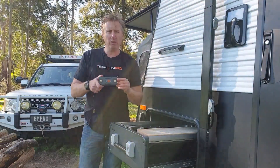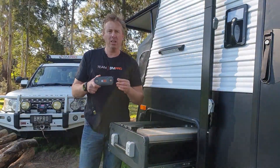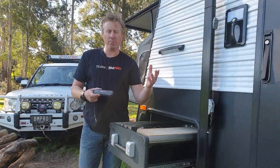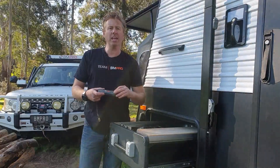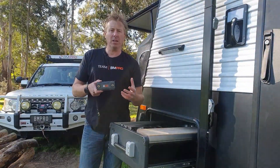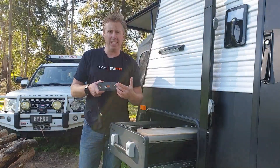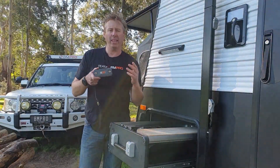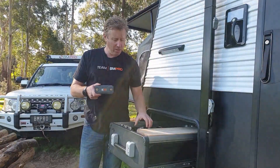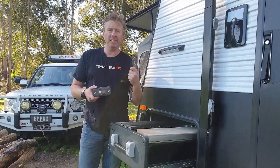So what we've got here is our BC300 Comlink — a really simple device. We install this on the negative terminal of our battery and then put whatever our connection previously was on the negative. We've got a secondary negative terminal on here. There's a shunt that runs in between, and basically we monitor and measure all of the energy that runs between these two points, so we can calculate how much energy is actually happening down at the battery.